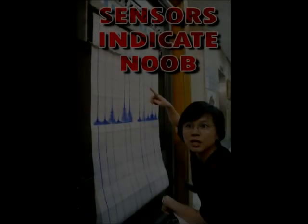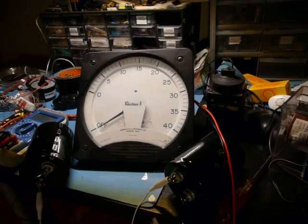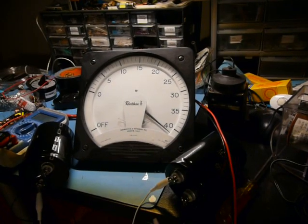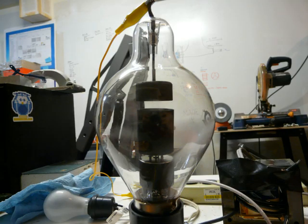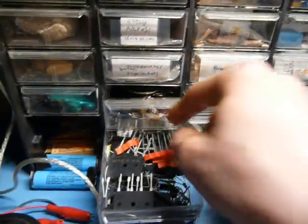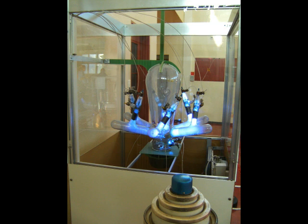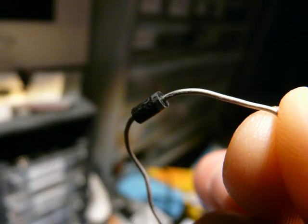Okay, I'm going to interrupt past me now to actually explain what we're doing. I was a little bit too excited at the prospect of shoving a lot of power through vintage pieces of glassware. A mercury arc rectifier is just a diode, similar to the silicon diodes you might use today. The purpose of any rectifier is to change an alternating current into a direct current, or put another way, to allow the passage of current in one direction but not in another. Silicon diodes do this by the semiconducting properties of silicon.